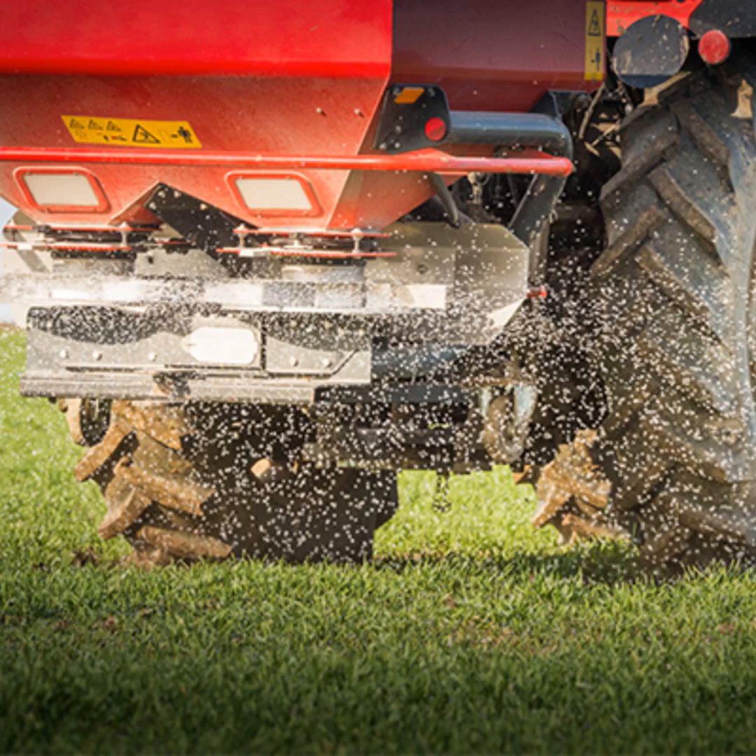If we assume the machine is right — greased, oiled up, ready to go — how important is setting it up on the tractor? Huge. It is simple, but I do a lot of talks around the country and you drive home afterwards and you see fertilizer spreaders lying to one side, lying to the other, or lying back — which is one of the big ones. Getting it level across the back of the tractor is critical. I know that man might only be moving it from one yard to the other, but I know for a fact that's probably not the case.